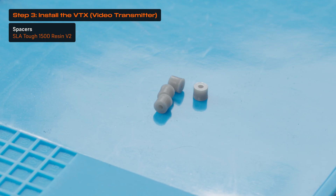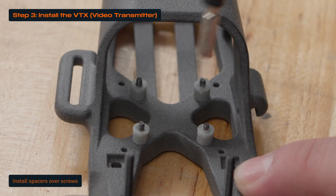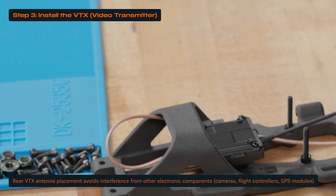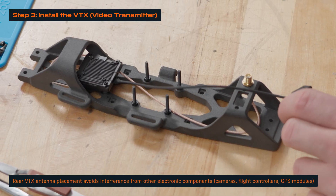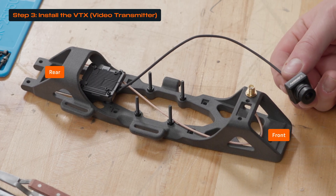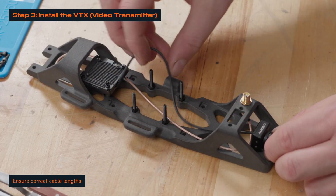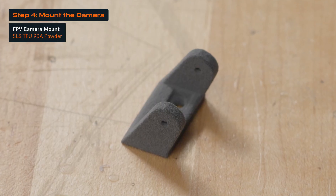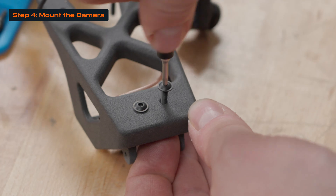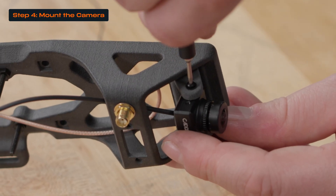Spacers are used to ensure adequate airflow around or below the electronic speed controller to avoid overheating and damaging the component. Place spacers onto the screws and secure the VTX to the mounting board. The traditional placement of the video transmitter antenna is at the back of most drones, near items susceptible to RF interference. 3D printing lets us customize this part so we can place the VTX away from these risks, but we must ensure correct cable lengths for both the camera and antenna to account for the longer distance between components. TPU-90A powder is elastomeric and behaves like rubber, so it's excellent for vibration dampening components like this camera mount. Place your FPV camera mount, printed in TPU-90A powder, on the mounting board and secure your camera with the small screws included in the VTX kit.